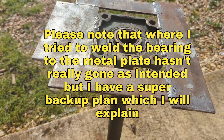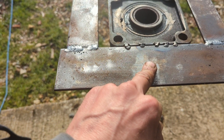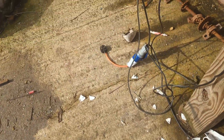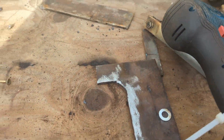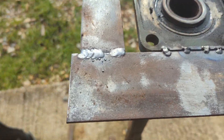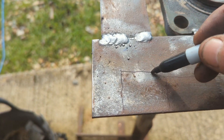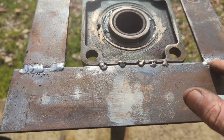I've made a fair amount of progress really. This will be the back of the device and that will be the front. The job of this thing is to act as a hinge, basically. The hinges will be around here somewhere — anywhere in this area should be fine — but I'll double check everything before I put it on. I'm just going to put some more weld on and then probably try and grind it down flat.